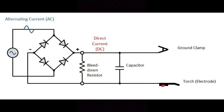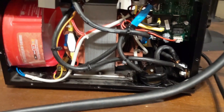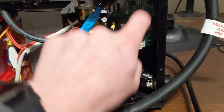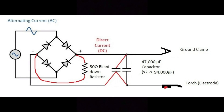This is a theoretical wiring diagram of the system. You can see the diodes of the bridge rectifier at center left. The capacitor is wired in parallel from plus to minus across the rectifier output, and the bleed-down resistor does the same — wired in parallel. Then you have minus going to the electrode and plus to the ground clamp. To wire it all up, I basically used the ground cable that came with it, though it was only about six feet long. I interrupted the output of the transformer before it went to the ground clamp and electrode, ran it to the bridge rectifier on the AC side, and on the DC side I have plus on one side and minus on the other. The bleed-down resistor connects directly to the output of the rectifier.